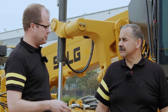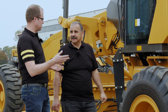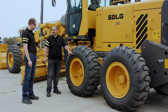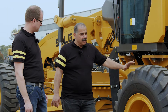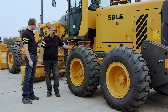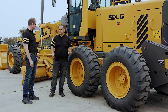Options available for this part of the machine include rear fenders for all four tires. Regarding tires, this machine is fitted with 17.5-25 size, but different sizes are available for different applications and grader models. Radial tires are available as an option, and biased tires are also available — useful when tender specifications require that the grader width be less than 2.5 meters.